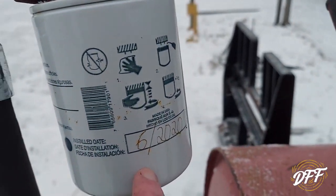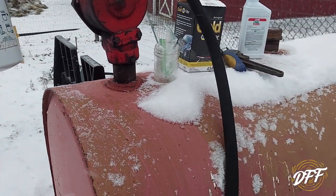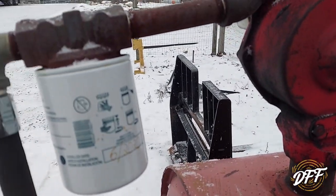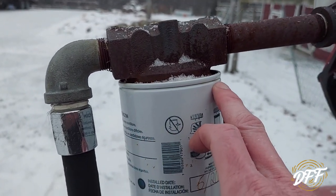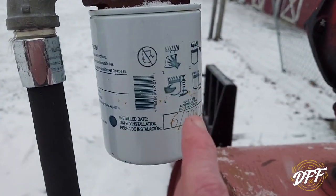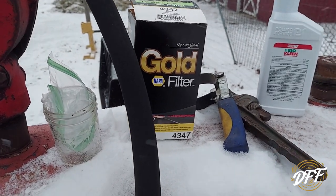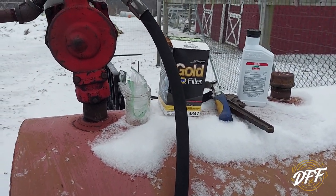Here's the date — I always scratch them in, I don't write them with a marker. I really find it hard to believe that I'm getting sediment from my tank into that new machine, but anything's possible. So we're going to take this filter off. I got another sandwich baggie to cover the top so we don't get moisture in there. We're going to drain that and might even cut the top off and pull the filter element out to see how dirty it is. I got a new filter — it's a bigger filter with better filtration. Just in case it is my fuel tank that's causing the issue, I'm just trying to cover all my bases.